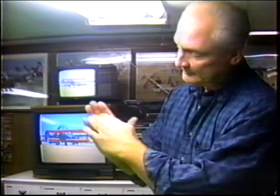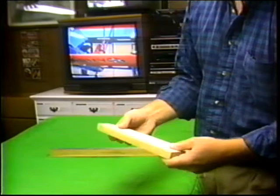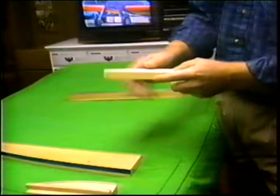So that's how I would do the flaps. For my elevator, I did the same thing, except I don't have the sheet metal strips on here. And since my Stuntress had a geodetic-type built-up stab, I didn't need a block to sand anything to, but this was how I was able to arrive at nice tapers. And then there's always a little bit of touch-up work you'd have to do.